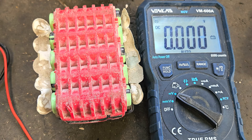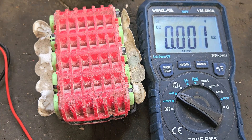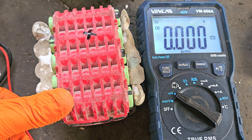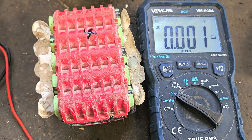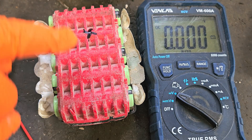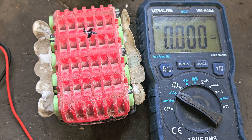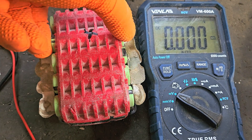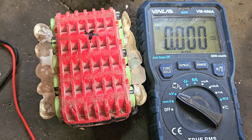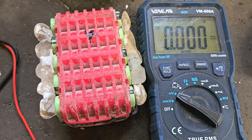Bosch, you're just a little different, aren't you. So this second bank has to be rebalanced. What I mean by that is these are all 4.09 and this one is around 3.18 or whatever. So we have to bring this bank up with the lithium ion B6 charger to match the rest, and that's quite simple to do. I'm going to show you how to do it now.